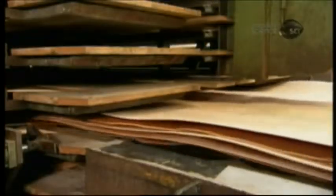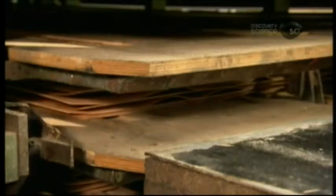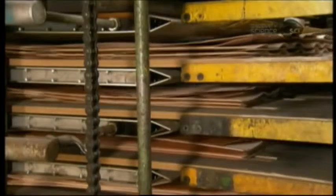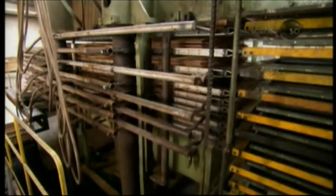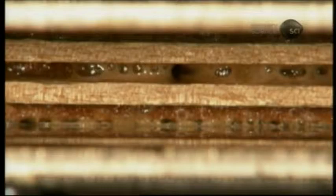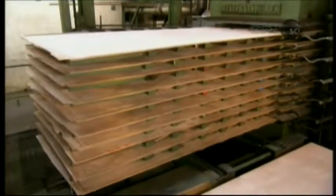Workers use a powerful pneumatic staple gun to attach the assembled core along the front edge so that it doesn't come apart as it enters the press. The press holds 10 core assemblies at a time and reduces the current thickness by 10%. It applies about 12 kilograms per square centimeter of pressure while heating the core to 120 degrees Celsius to literally cook the adhesive. The core exits the press after seven minutes, now perfectly flat and solidly bonded.